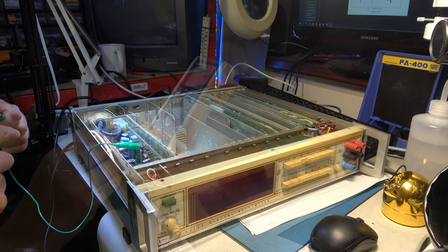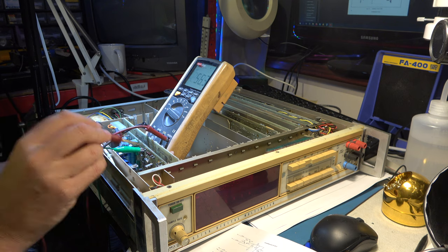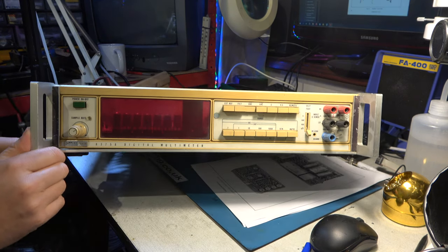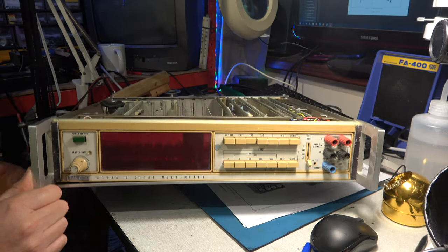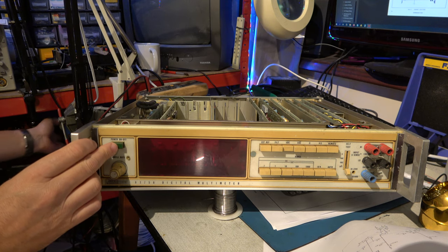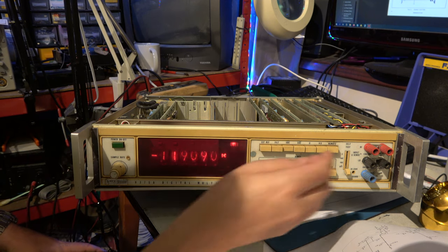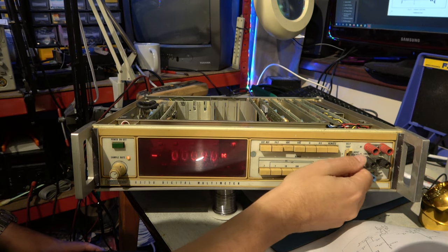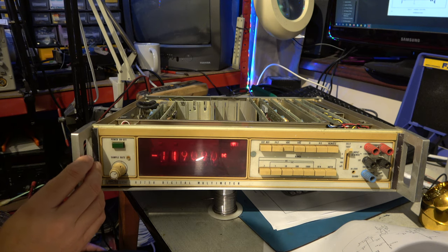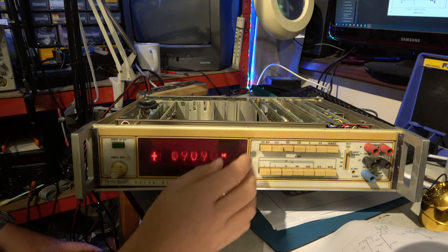Let's see now if any of the voltages come up — 193 volts on the 200-volt line. I think the display's lit up! Let's have a look. We might be getting somewhere here. I'll switch off a few of the studio lights so we get a better view. This is exciting — you'll be seeing this for the first time as am I. Something's happening — self test. I've got something on the display, which is more than I've had before. It's sampling but I seem to be getting gobbledygook on the display. It's making odd noises like relays are triggering.